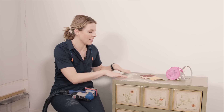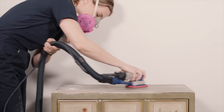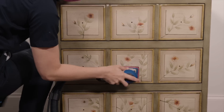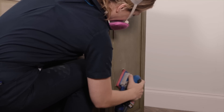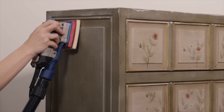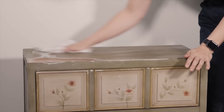I've done the corrective sanding on the top to smooth it out so my surface is nice and even. Now I'm taking some fine sandpaper and giving the whole thing a scuff sand so my paint will stick really well, because this is a factory finish and it's pretty glossy. I'm using regular sandpaper on flat surfaces and a foam pad for the decorative curved areas. If you didn't want to spend time scuff sanding, you could use a primer like Slick Stick for adhesion. Afterward, I remove the dust with water and a rag.